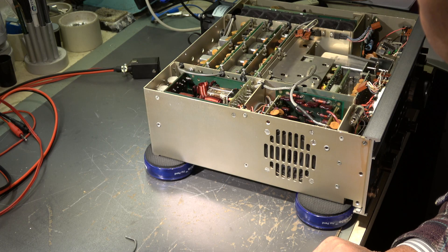I will also look for any other faults and check the connectors on the rear side. They have some connectors — for example, the connector for the loudspeaker has automatic switching between internal and external loudspeaker. I've seen there's also something not okay there. The contacts have to be cleaned from the switch-over contact, and also the transmit-receive relay. I will not show you all things in detail — it's boring, you know how to do it — I will only show it as an example on one or two of these boards.